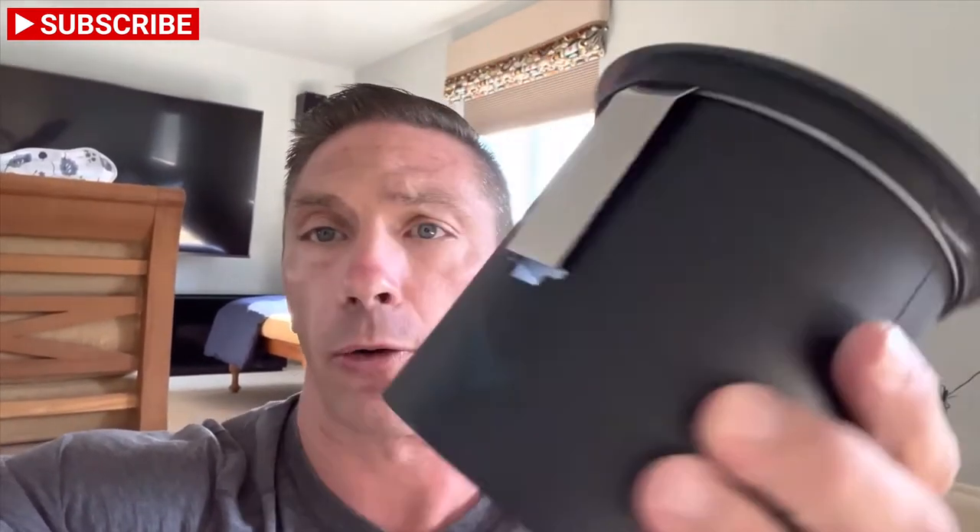It's going to make a huge difference in the space. We have stuff over here with the fan that we're not touching, but the nice thing about DMF is it doesn't have to be new construction — it can be retro. We have the electrician here right now, and we've got these cool retro cans from DMF. They come with a template, you cut the holes and wire them in. Over there on that door is a light switch — right now it's a dual gang and we're going to make it a triple gang so we can have everything together with a manual dimmer.